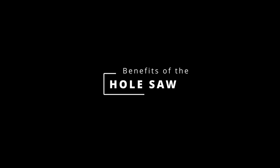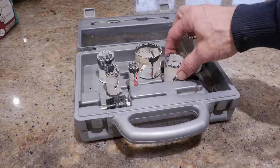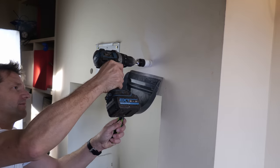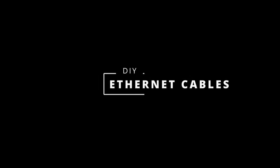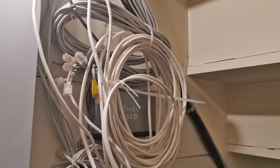I was nearly done and just needed to drill a couple of holes in the plasterboard for the cables, to avoid that mess of cabling you saw at the start. I don't use this hole saw set that often, but it's an incredibly important thing to have in your toolbox for when you need it. I also drilled a larger hole through the chimney breast with my 25mm SDS bit, in the hope this would be wide enough to route all the cables back to the plug socket, set-top box, and ethernet sockets. Back in 2010 on the advice of a friend I had routed network cables from each room downstairs to a cupboard under the stairs where my modem was. I never at the time installed a network switch to patch the cables into, but this means I've got an ethernet socket on the other side of this chimney breast — and I wanted to create a short network cable to connect the TV to that ethernet socket rather than rely on the wi-fi connection.